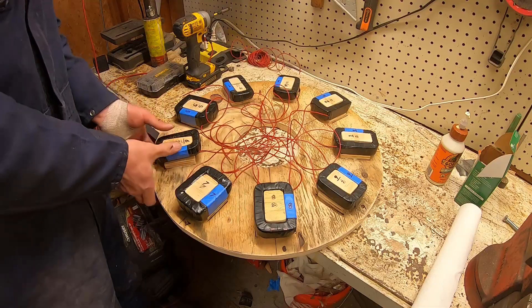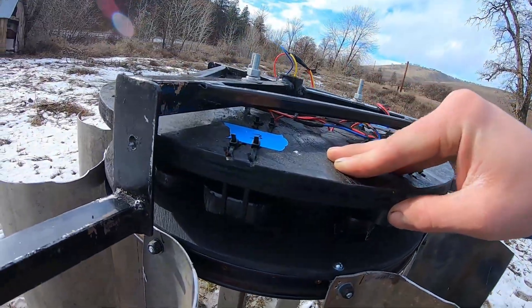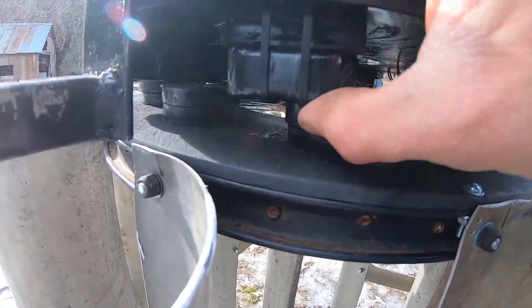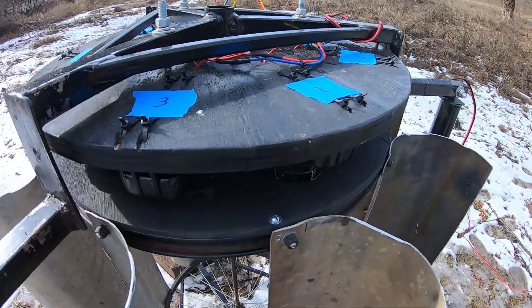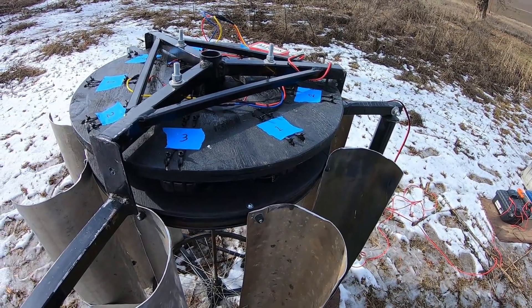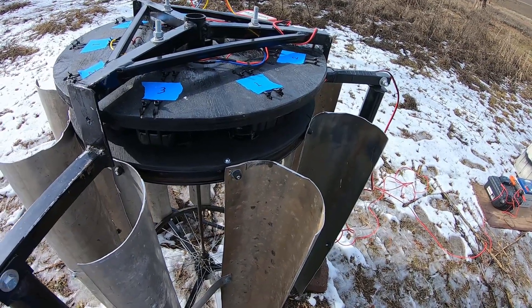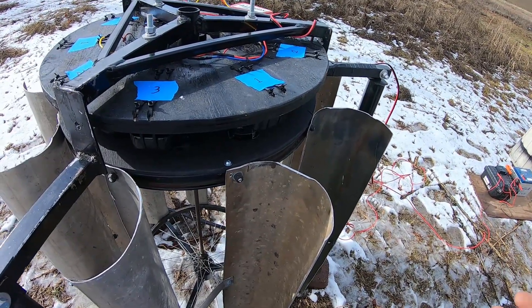I wanted to minimize the amount of metal in the stator because I don't want any cogging with the magnets being attracted to steel. There are just a couple of screws — two going through the top and one holding the two pieces of plywood together more firmly. The coils are zip-tied into place; I just drilled holes and zip-tied them. These are more than strong enough, especially for something that's meant to be quick and non-metal. I don't want to damage the coils. Some of the coils are aluminum wound, and I do not like aluminum winding — it's a pain to deal with. Unfortunately, a lot of step-up transformers in microwaves you'll find are aluminum windings, so that's something we had to deal with.